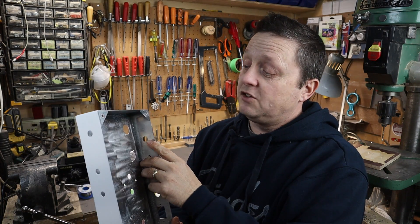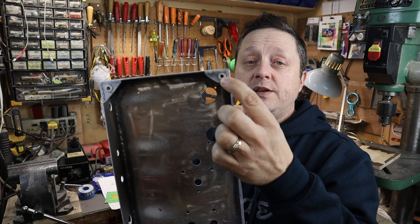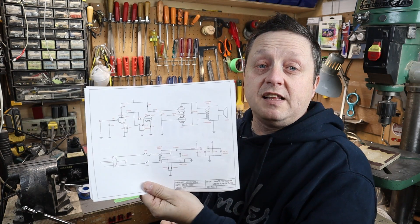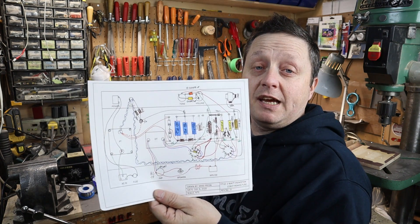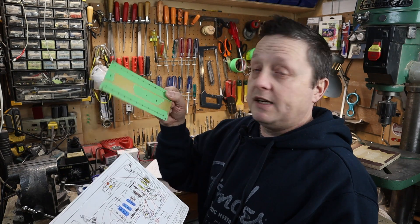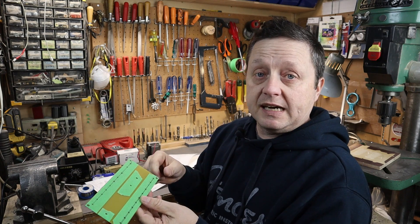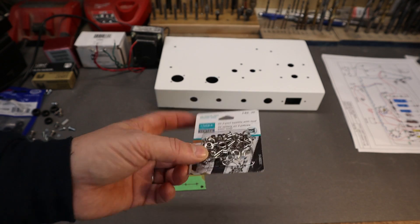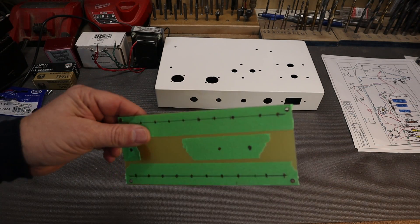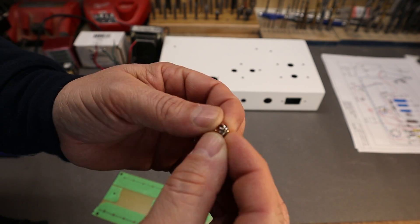The chassis is all completed and the paint is cured — turned out pretty good. I inserted some 10-by-24 threaded inserts so I can mount it on a board or make an enclosure. I've also got the finalized schematic so we know all the values and voltages, and a crude layout of the amplifier design — I'll do a proper one once it's up and running. We're ready for the eyelet board — we transferred all the holes and measurements onto the phenolic, drill all the holes, and press the eyelets in. These are two-piece eyelets: drill the hole, sandwich the two pieces in, and press them in with the tool.